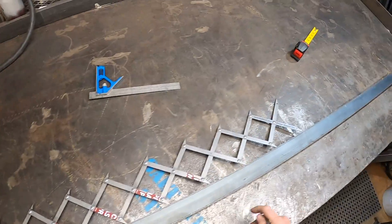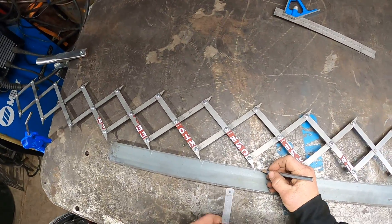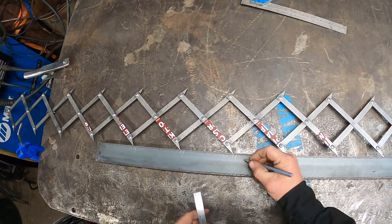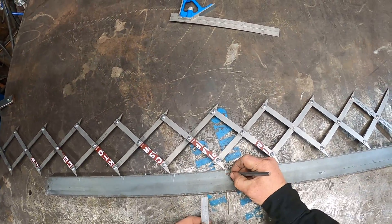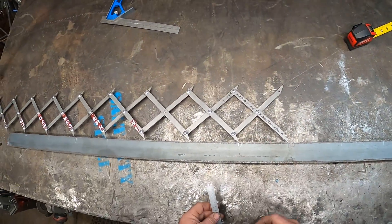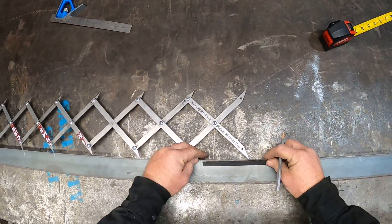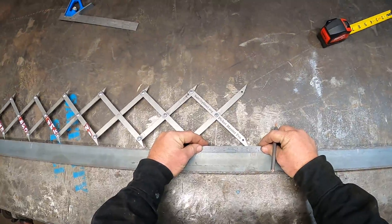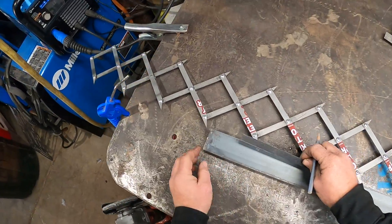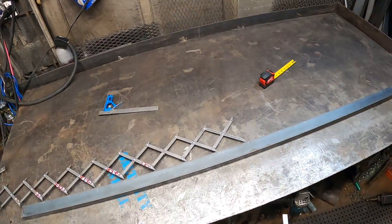You've got to mark those like you're building a wall with studs — you always have to remember which side to mark. You do this a few times and you get the hang of it pretty quick. This one's going to go on that side. We can go ahead and add a picket in so we can mark the other side if you'd like — you do not have to if you can remember which side you are. Four and three-sixteenths right there, and over here it's also four and three-sixteenths. So all those are the same.